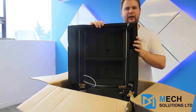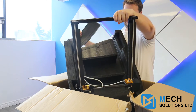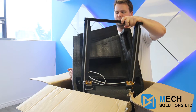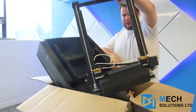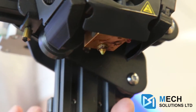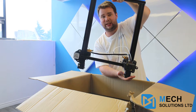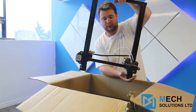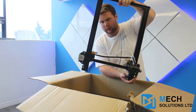There we have it — that is your dual extruder frame. As you can see, it has two Bowden tubes, because it does require two filaments. It is only still one nozzle, because both Bowden tubes lead into it, so it can actually print both colors out of that singular nozzle. That does confer a couple of advantages I'll talk to in a bit, but that is something to note.